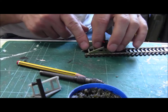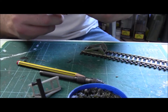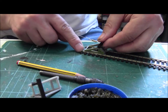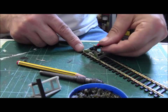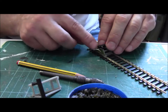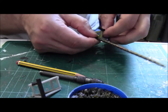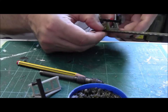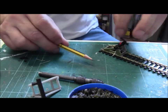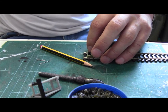It's that leg. Now the other leg, you've got to bend it out over, because the reason being is you haven't got enough length to get onto this rail. So put it through there — that goes over there, no problem. That one then, you've got a shape — down there, onto that rail, like so. Solder that one onto there. There we go.